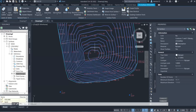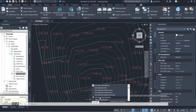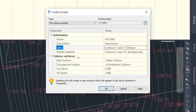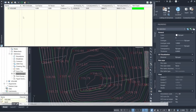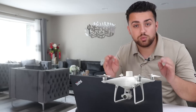In the object viewer, the stockpile surface looks correct — it matches the hill outside. Now to calculate the volume: in the command line, type 'volume' to open the volume dashboard, then select Create New Volume Surface. Name it 'volume', select the base surface as the base, and the stockpile surface as the comparison surface, then click OK. We've now computed the volume, and according to this calculation we have 8,660.71 cubic yards of material in this hill. If you want to learn how to do volumetric measurements using a drone, subscribe to the channel — that video is coming soon.